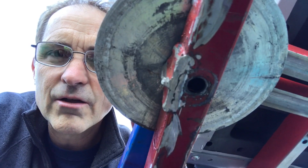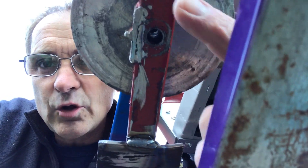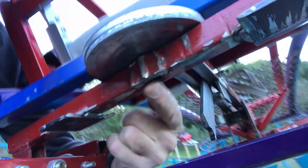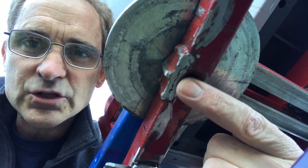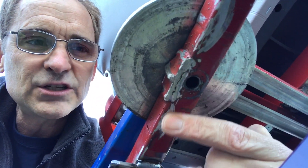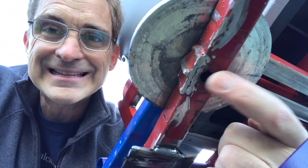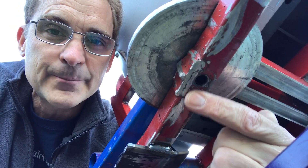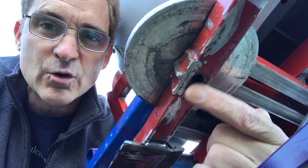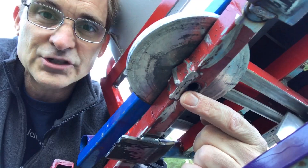That's not even the horrifying part. The horrifying part happens when you look underneath the cart. This whole piece of steel here — which is the wheel assembly — it's caving in. It has also yielded; it is also bent. So we need to change the whole way all of this is being done, because this is not safe. We are destroying the cart a little bit every time we go over it.